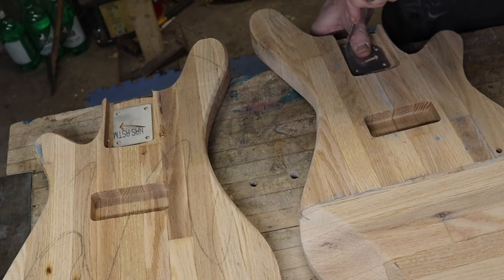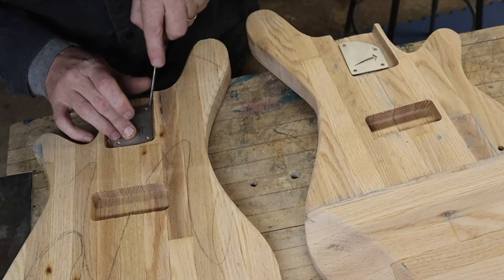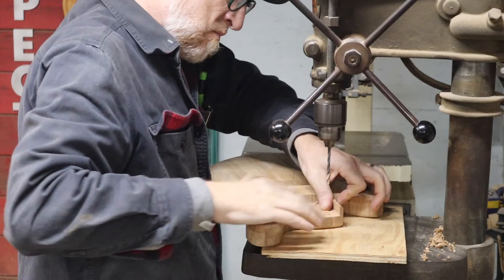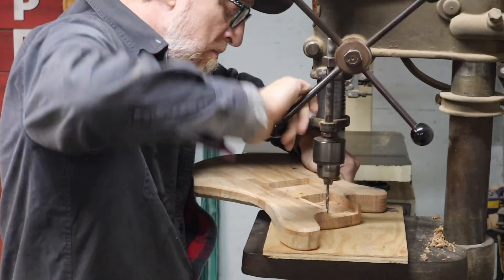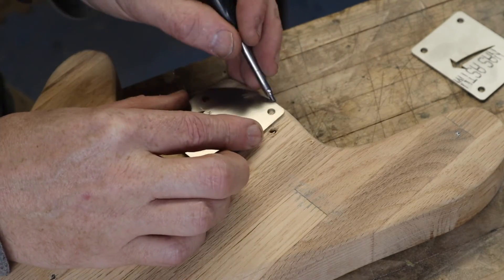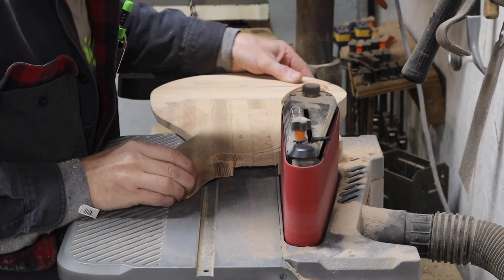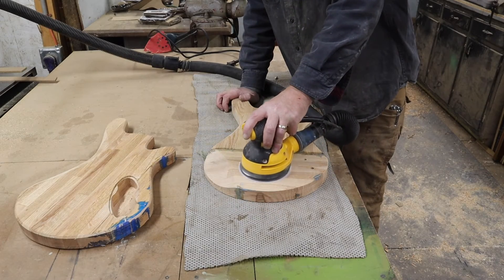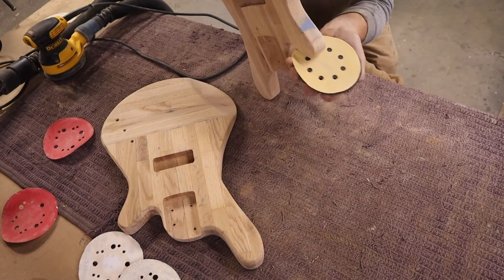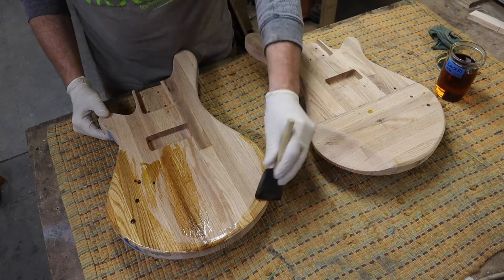I use my neck plates to align where I'm going to put my screws and figure that out. I have one neck plate that has an angle to it — a different style — and I thought I would go in by hand and cut the heel to fit that angle. Using my drill press, I figure out exactly where the plate's going to be and then cut to get that look right on my belt sander — took like a minute. Then of course there's the sanding — lots and lots of sanding by hand and with power sanders. I brought the whole thing up to about 320 grit before I put some linseed oil on it, because I like to really bring out the grain and the color a little bit before I finish it. You want to get that linseed on there and then let it sit for a few days before you put finish over it, depending on what kind of finish you're going to use.